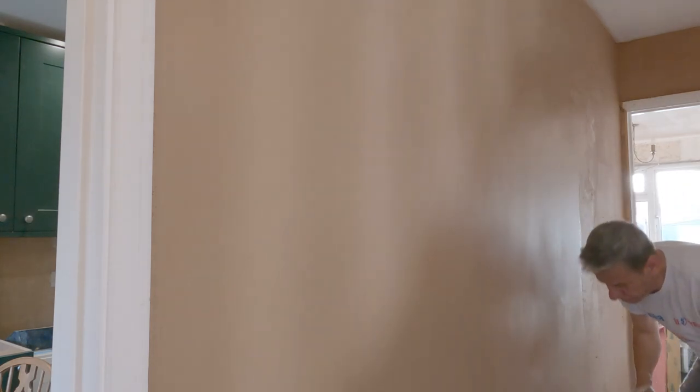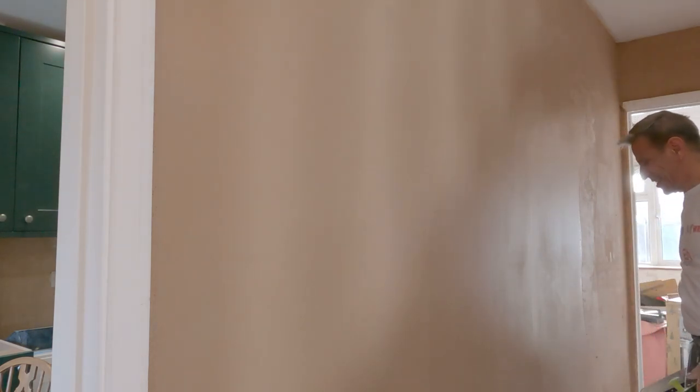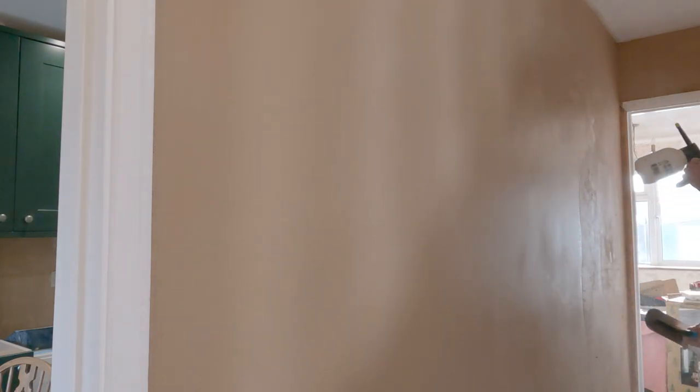At this point, the fat I'm getting off it you can use for filling out, because it's still the same colour, and it's just something you get to learn about consistencies of plaster. Plastering down to radiator pipes that run along the top of a skirting is doable, but they're a pain in the bum.